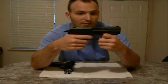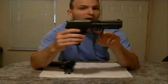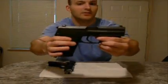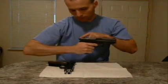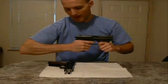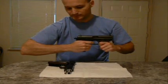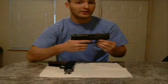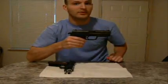So for instance, if I release it in this case, and it's in the down position, now look at how much farther that trigger is here, and that gap, that distance between the two. And now as the user pulls that, you'll see this hammer here come back as I pull that trigger until it releases. Now after it releases, if it was to fire and cycle, then the firearm here would now keep it back into a single action mode.